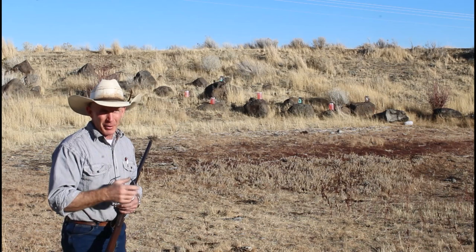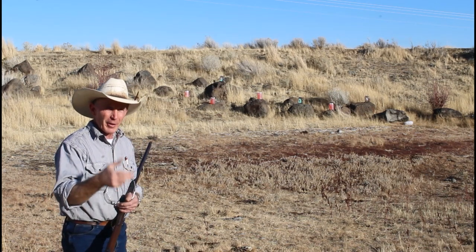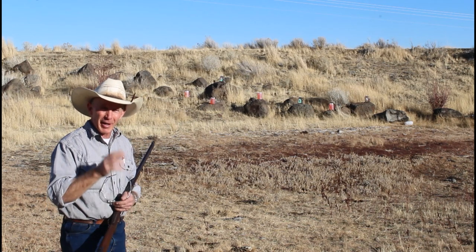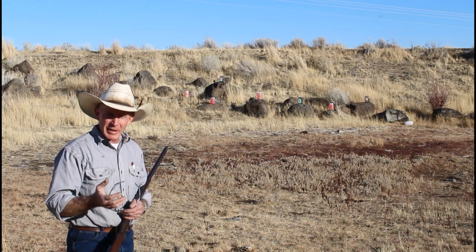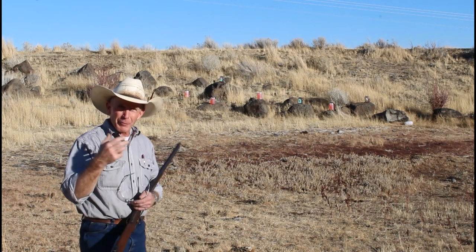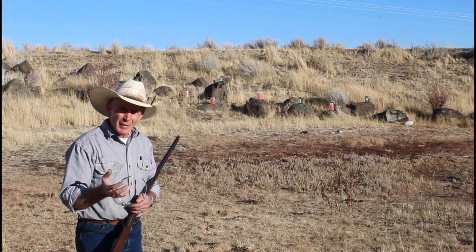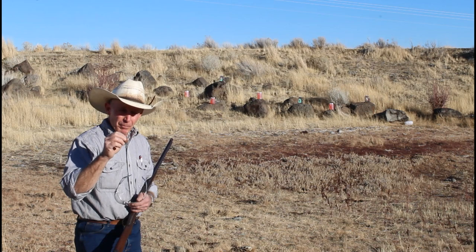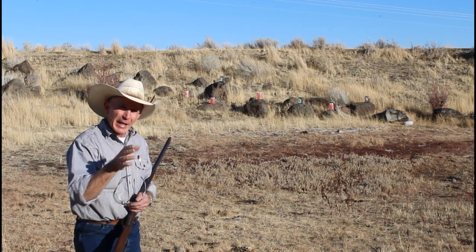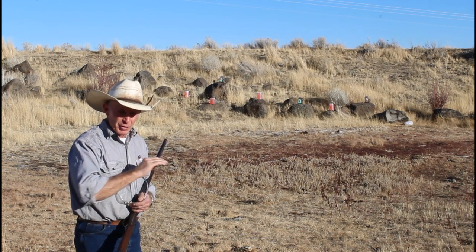Started out draw filing all those pits out, and then went from a coarse sandpaper to finer and finer until we finally got it polished up just right for bluing. It's an interesting process. If you don't have the gouges or the pits, you start off with sanding and polishing, and you just go progressively from a coarser grit to a finer grit, and you change directions each time so that you can see that you're getting those scratches out.